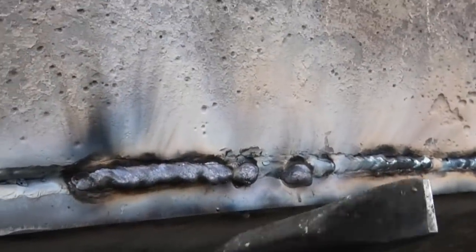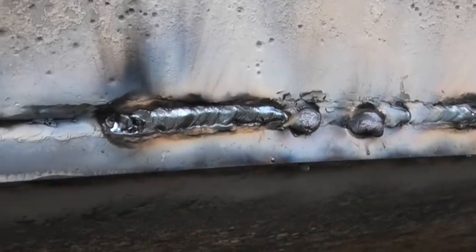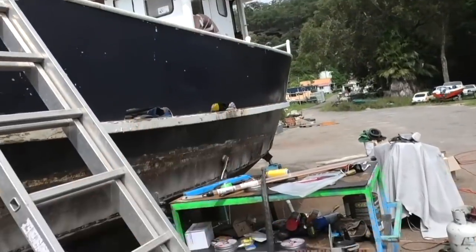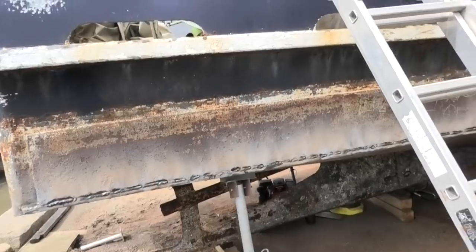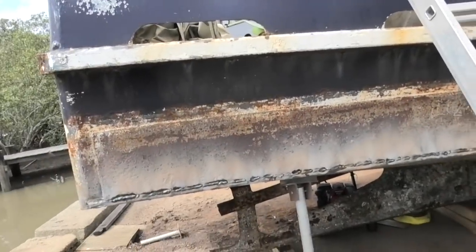It's a little bit slow — this is as far as I'm getting with each rod, but it's kind of relaxing. Finished the second pass all the way along the boat now. What I'm going to do is put the flap disc over it and the wire wheel over it, inspect it, and touch up where I need to with the 2.5mm rod.